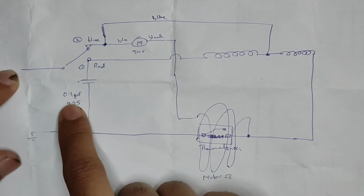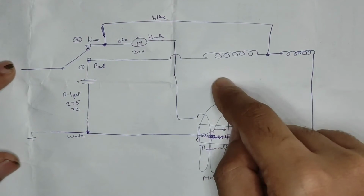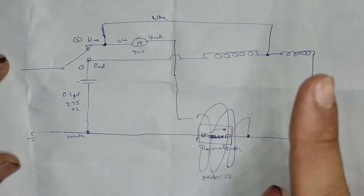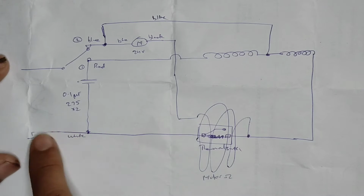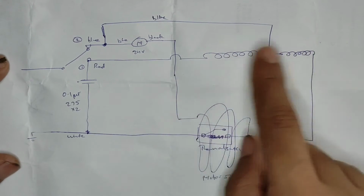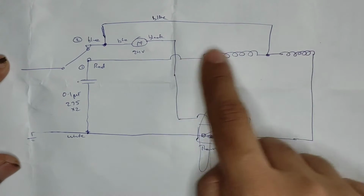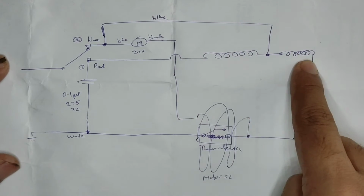And now let's talk about the interesting part of this, the second mode, which is the higher temperature mode. So when you connect it to the second mode for the higher temperature, the 600 degrees at 500 liters of airspeed, both the temperature increases and the fan speed also increases. That is because now you can see the neutral is again common for both the coils, and this is what I said as the center tap configuration, because you can see the common wire is in the middle and two sets of wires on the other sides. So it's like a center tap configuration on this side.